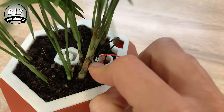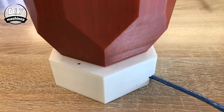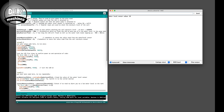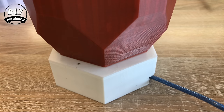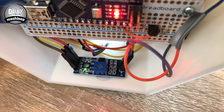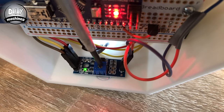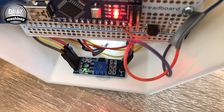Download the code from the link in the description and use the Arduino IDE to upload it to your Nano. Open the serial monitor — the LED should flash five times quickly to confirm the code is running, then the serial monitor will print the current water level reading. After a few seconds, you should hear the pump start up, and the LED will blink to indicate no water is in the tank yet. The soil moisture threshold is set by turning the potentiometer when the soil is just at the point you'd like to water again — turn it until the second LED comes on, then back slightly until it turns off. That sets it correctly.